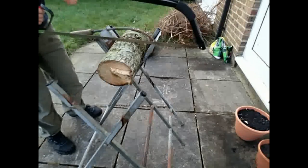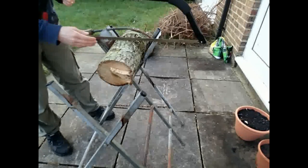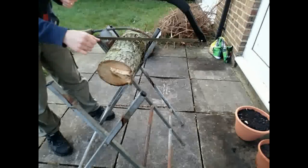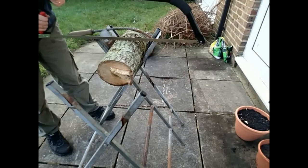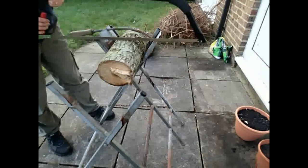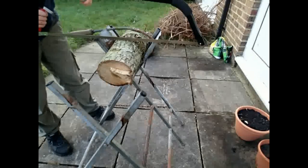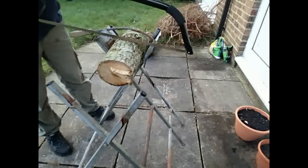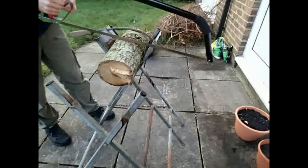What we're going to do is make sure the area that we're going to cut is long enough for whatever purpose you want. If you really want longer pieces then clearly you're going to have to use a longer cut and make sure you've got enough clearance for your hands either side. I'm cutting it quite short because it's going to go in a fairly short burn chamber of my wood burning furnace. All you want to do is a couple of small cuts at the start — this is just to get the teeth set into the wood.